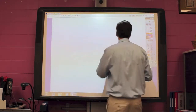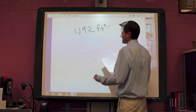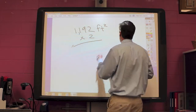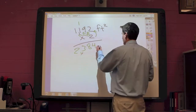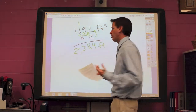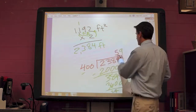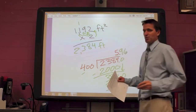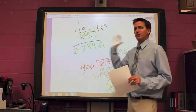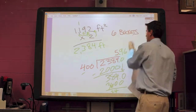So what I have is my total surface area, which is 1,192 square feet. I'm timesing this by two because we want two coats, which gives me 2,384 square feet. The next step is to divide this by 400, because that's about how much one bucket will hold. We have 2,384 divided by 400, which is 5.96. But we're going to round up — because you can't go to a paint store and ask for five full buckets and then 0.96 of another. So my answer is we need six buckets of paint.